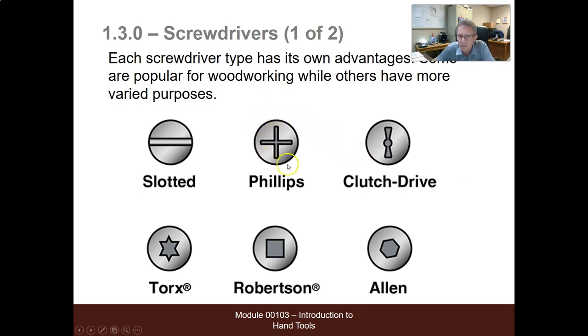I don't want electricians using a Phillips head screwdriver unless that's the only thing you can use — meaning, if you have to take apart an air conditioner cover that requires a Phillips head. But for inside the terminals and everything else, I'm going to use a slotted, square drive, or Robertson. Don't do electrical work with a Phillips head screwdriver. Clutch drive, Allen, Robertson, Torx — those are special shapes used with tamper-resistant fasteners that an average person wouldn't have.